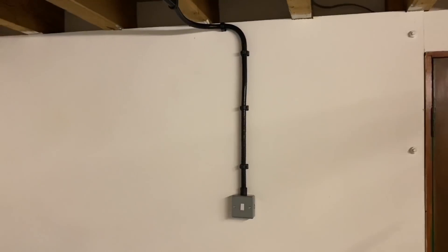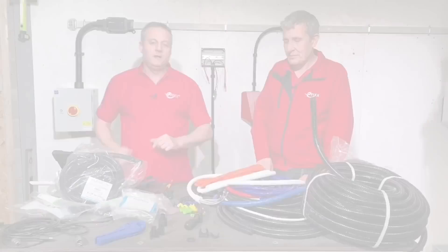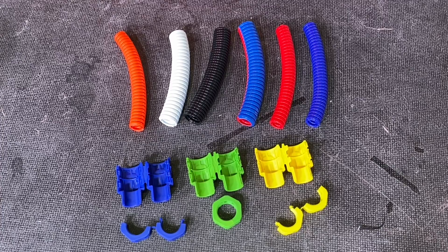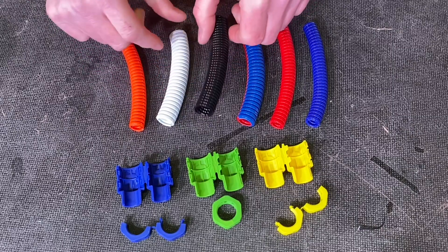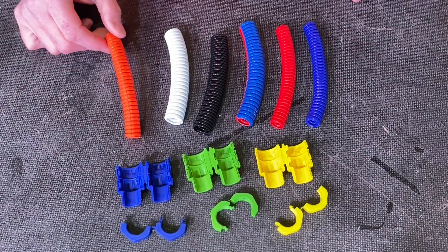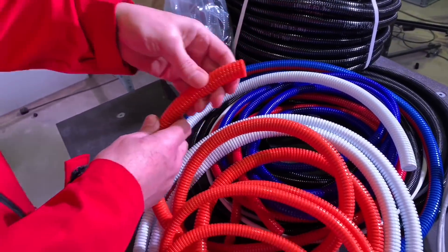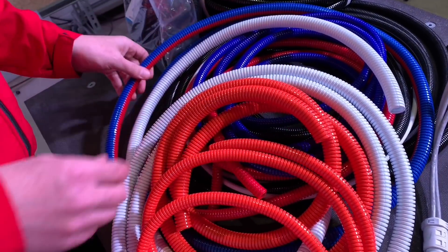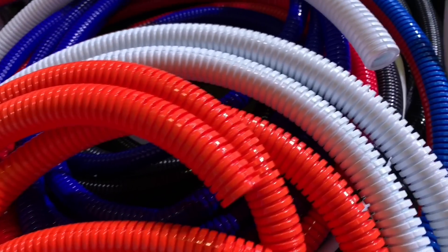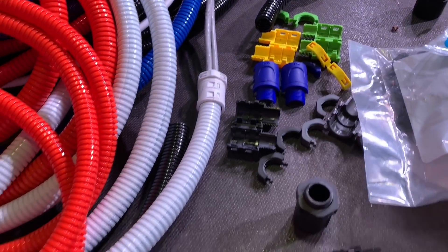What's the ambient temperature range for this conduit system? It goes all the way from minus 40 degrees C up to a massive 120 degrees C. We've seen black conduit, but there are plenty more colours - white is popular for aesthetics, grey if you want something in between. They can make them in almost any colour, not exactly off the shelf, but it's possible. There's also orange - you may remember that the standard colour for painting conduits for electricity is orange. Sizes range from 11 to 54 millimetres external nominal diameter, with inner diameters from 7 to 45 millimetres.